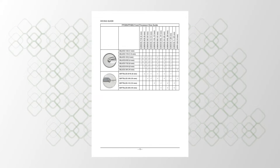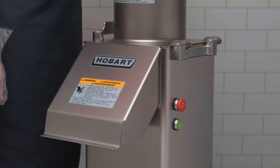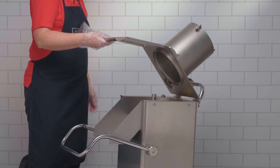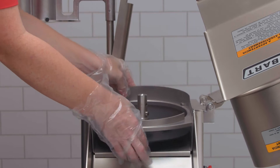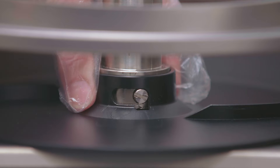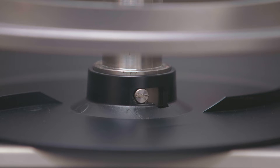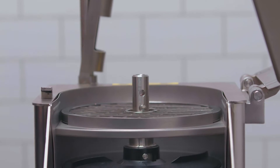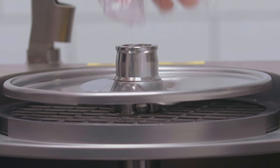There are a wide variety of cutting and dicing options outlined in your manual. When installing the cutting tools, always push the red stop button before changing the cutting tool. Pull the locking handle all the way open. Rotate the feed cylinder until it locks on the storage handle. Lower the ejector plate on the knife shaft. Rotate the ejector plate until it seats on the drive pin of the drive shaft. Select the appropriate cutting tool for the job, place it on the shaft, and turn until engaged.